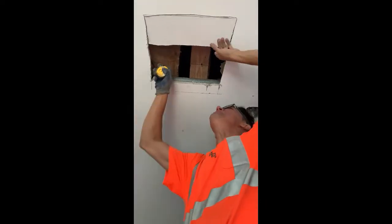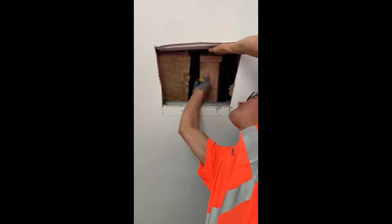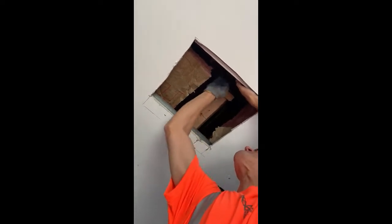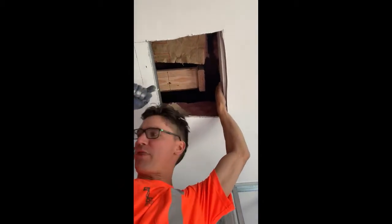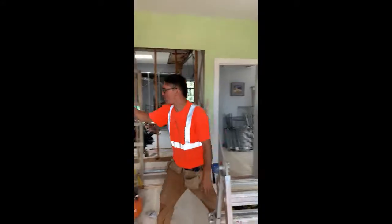It's about 114 years old and it's got a drop ceiling down here. But we connected our 2x6 — kind of an I-beam here — connected it into the old wood joist, so it's really well tied in. There's some construction adhesive and some exterior grade roofing screws with the star head. And then we did our precise measurements. We're going to drop a threaded rod down from this I-beam and connect it exactly in this spot right here.